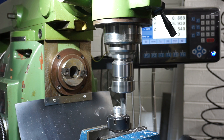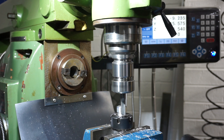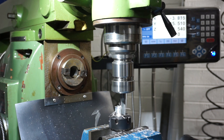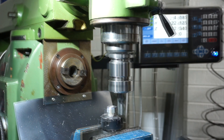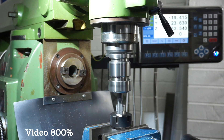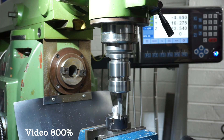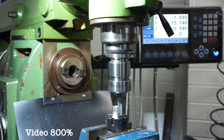The DRO Y is at 16 and will drop down to 15. I'm taking it easy - I don't want to be too savage on it. It's only aluminium, and I could have taken one cut, but I didn't want to risk rejecting the part from the collet block. I'll speed this up now and index the collet block around 60 degrees at a time - simple indexing with a six-sided collet block and an ER32 19 to 20mm collet.